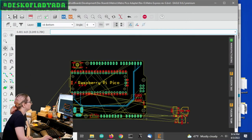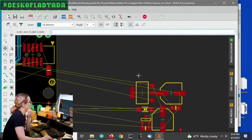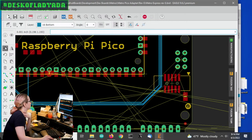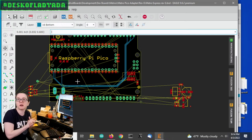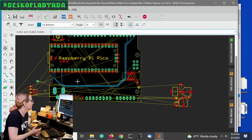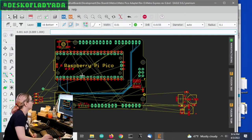And then the good news is that I can still probably put the power supply over here. I just have to make sure that I need a ground plane underneath this regulator to make sure it can handle the 9-volt power supply and provide enough power. So, oops, move this. I just have to make sure that the ground plane I have isn't going to be cut up by that, underneath all those wires that are underneath. So I guess I could keep routing if people want, or if they have any questions.